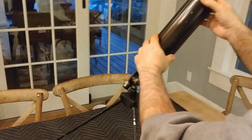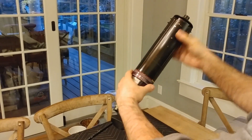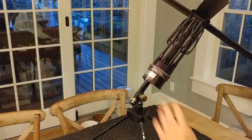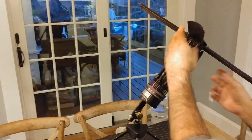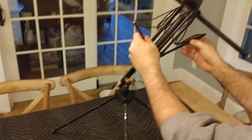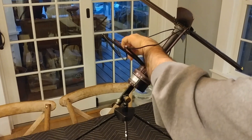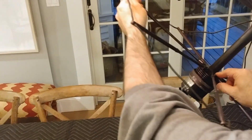Next, you start opening up the reflector element. This is kind of neat. You pull this ring down, and out comes what is actually the driven element. Then what you do is fold down — this is the reflector. You fold this down and then expand to the full length all of these little elements.